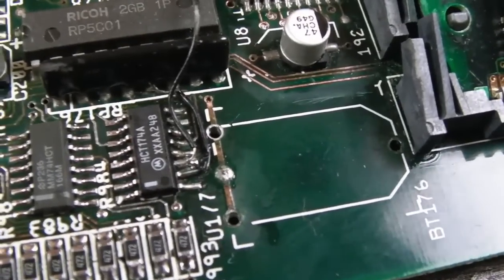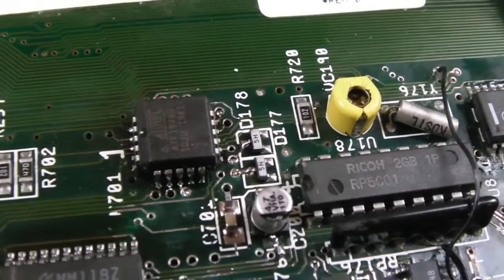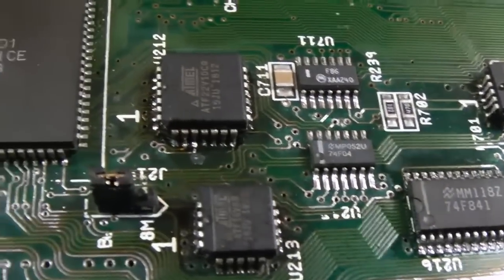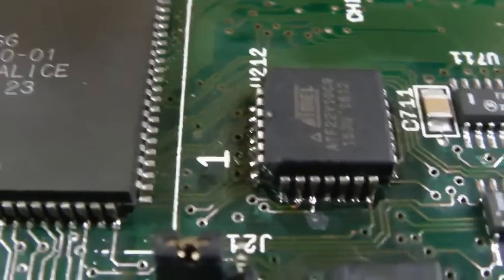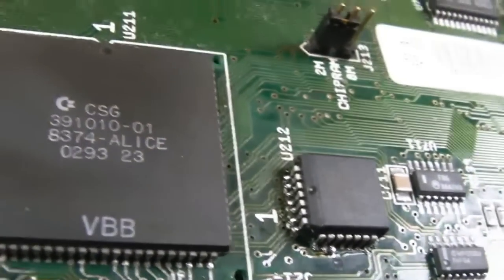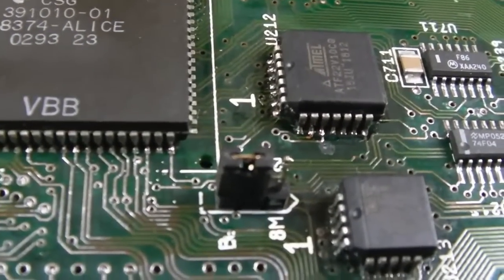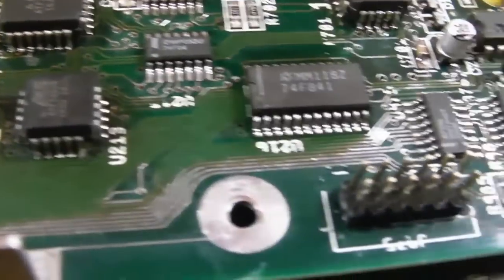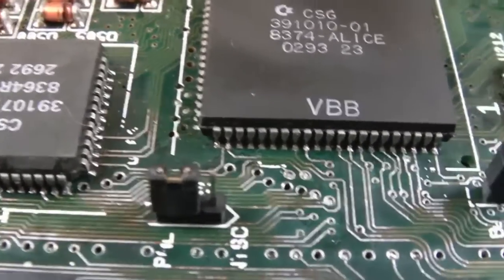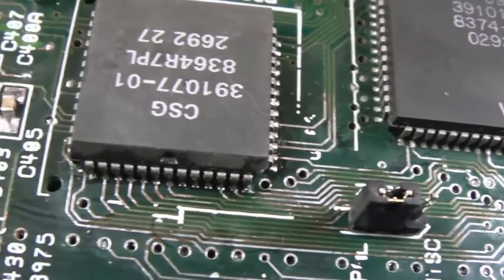I've just measured the battery, because one of the things he said was the real-time clock is defaulting. Well, it's 0 volts, so it's no wonder it's defaulting. I don't actually think there's a real-time clock fault, but there is the odd via, like I say, and pin. You can see the pins on the GAL there look a bit weird. They need reflowing. Someone else reflowed them previously, and it's the same all around, with the odd via around those. So, jumper replaced, brand new pin header and jumper, brand new pin header, and brand new pin header. Again, just one or two pins need the odd reflow, but it's looking 1,000 times better.